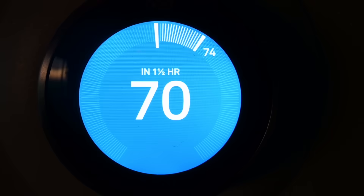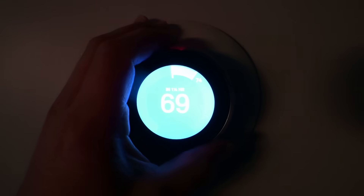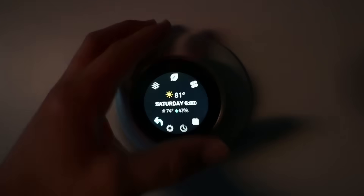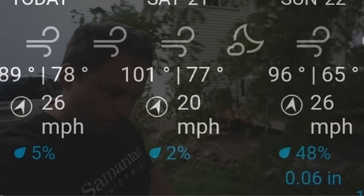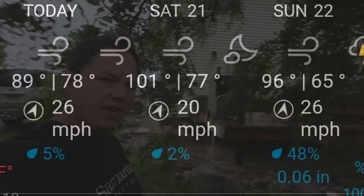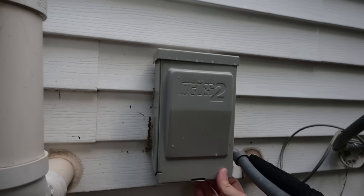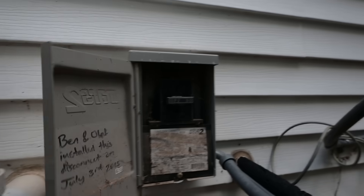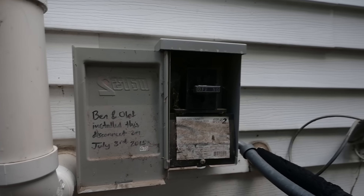It's like 6 a.m. Last night we had the AC turned down to about 70 degrees, and this morning I woke up and it definitely was not 70. Today's forecasted to be the hottest day of the year so far — 101, I think is what it said last night. I've already turned the power off in our disconnect right here. Without even opening the side cover of the air conditioner, I'm pretty sure that it's a capacitor.